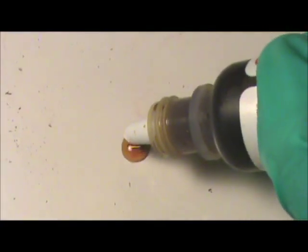Sure enough, when I cut a small piece of this off, remember what the tine of the fork sounded like when I cut it? There was almost no sound at all. With that, it's much more of a clinking metal sound. This will probably go ugly straight green right away. If it's that blue-green, that's a sure sign that we're not dealing with silver. Again, do it in a well-ventilated area and make sure you wear gloves so you don't damage your skin.